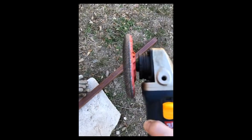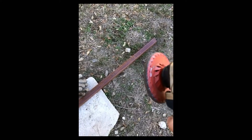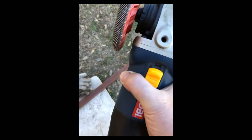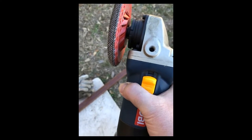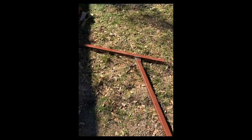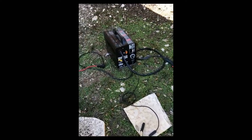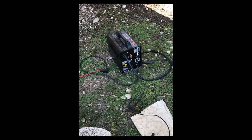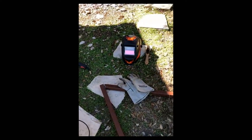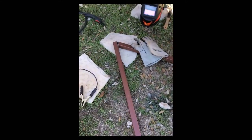To clean up the metal I'm using the angle grinder with a flap disc. I'm going to clean it up where I'm going to be welding it - I'm not going to try to film this one-handed, so I'll put on my gloves and eye protection and go ahead and do this. I've got my pieces of metal ready and cleaned up, and I've got my little wire feed welder and my welding gear, so I'm ready to spot weld this thing up and see if it fits.